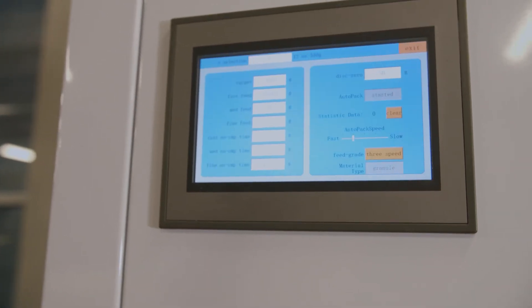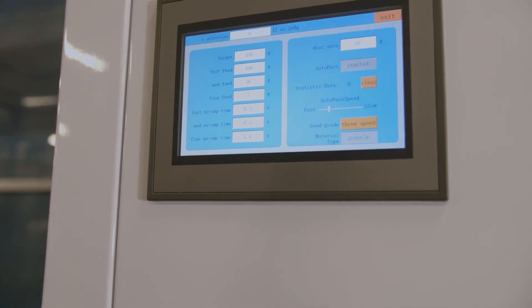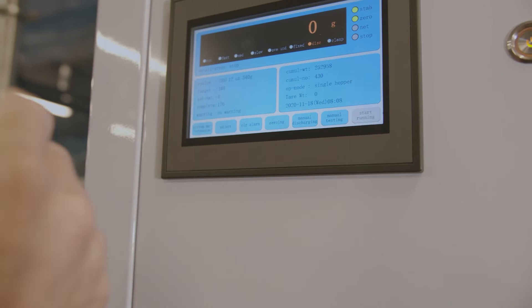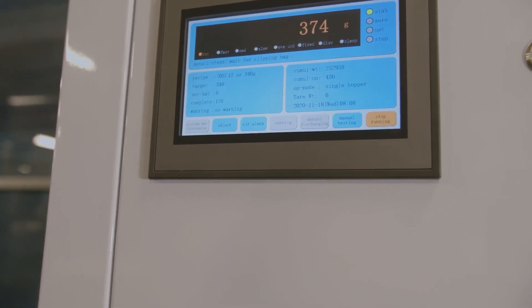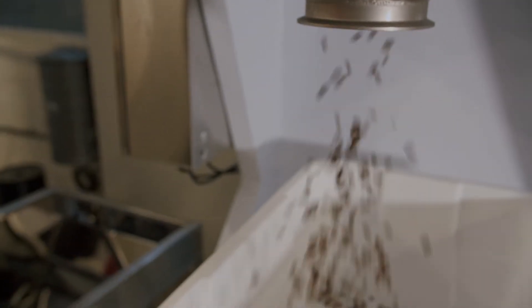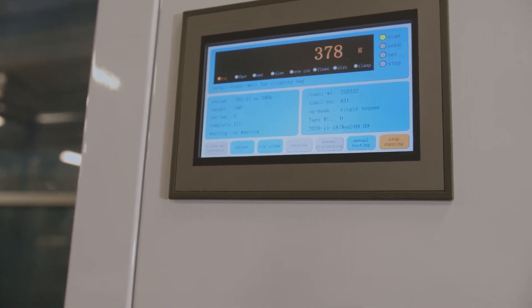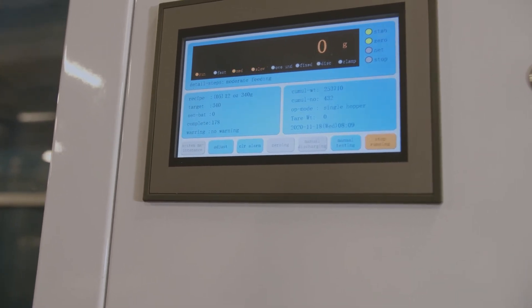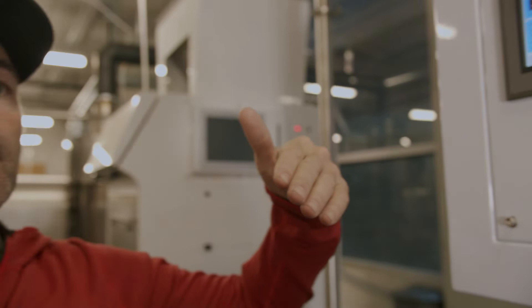Let's say you're getting greedy and want to fill really fast. You set your medium feed really low. Go into adjust — I'm going to set it to 30 grams. That means it's going to fill with medium until 310 grams, which is too low. It doesn't have time to downshift to fine properly, so you're going to be all over the map. Start running and you'll see it blows right past 340 grams — 374, then 378. The weights are erratic and I'm way past my target weight. If you're blowing past target and weights are erratic — not within 2 to 4 grams of each other — you have a medium speed problem.